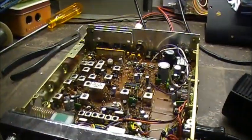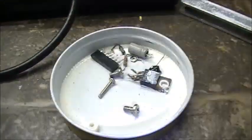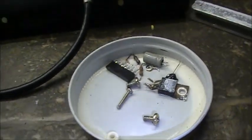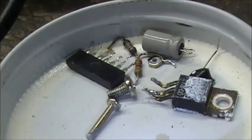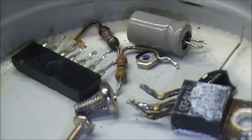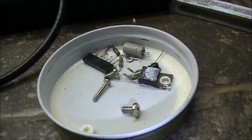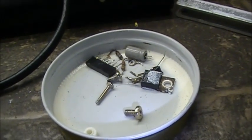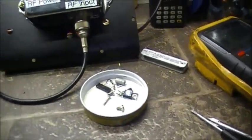Okay, after spending an hour or so messing around with the output section, I discovered that there was a bad final in there, as well as a bad 21-ohm resistor — also shorted out. Now that might just be showing a short on my meter, mind you. So anyway, I replaced it — just put another one in there just in case.